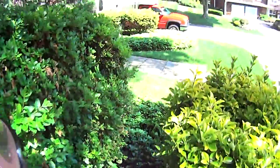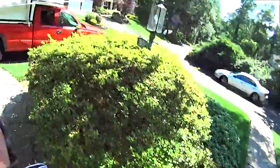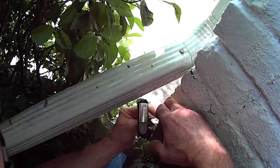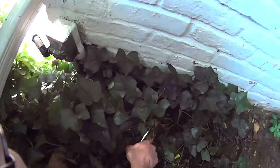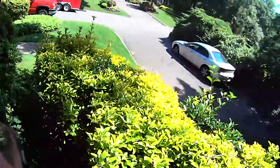I'm just going to put a piece of weatherproof tape over there and we're done. As we're walking out of here, we should see that the lights went off with the photoelectric control — and yes, they're off. That job is done. Those two lights and that one were all controlled. We're going to seal up this box so the water doesn't get in. Here's the old photoelectric — we'll take it with us. This can go in our electronic recycling bucket in the handyman zone, because we're a green handyman.